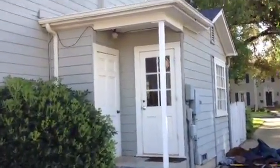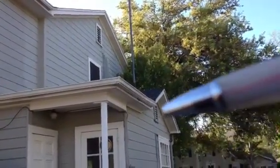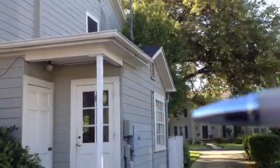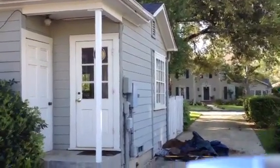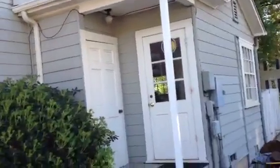Both these doors, gable vents on both ends. We have 2 gable vents, one right here up top, one down below on the lower gable. Those would all be wrapped. This upper story window here, these 2 doors, this window, would all be wrapped in Hardie plank 1x4. All these electrical boxes here would be pulled away. We'd side behind and then reattach the boxes.